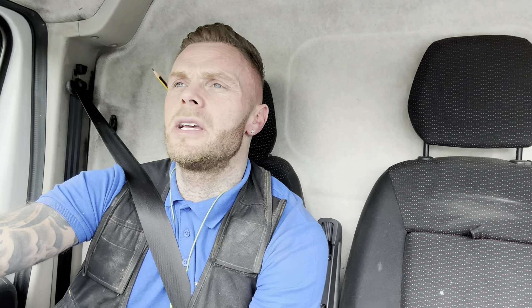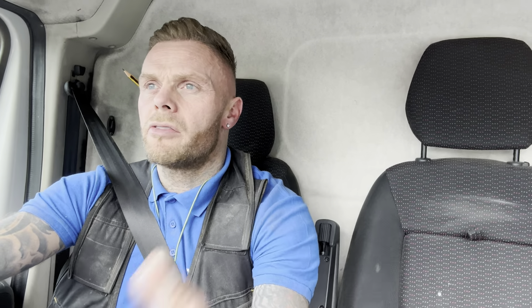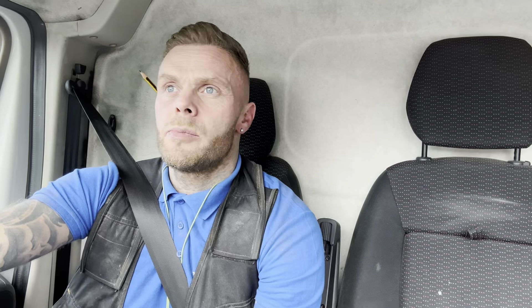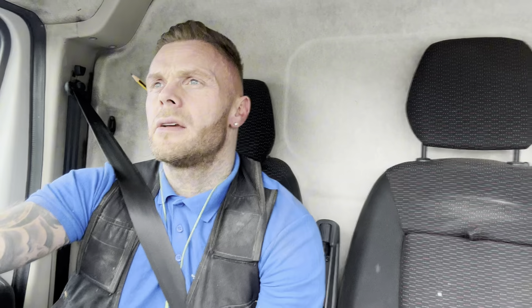Onto the tips - I'll show you all this when I'm in the booth as well. We typically tend to stick with a 410 tip, which is supposed to give you like an eight-inch fan pattern. If it's got a four at the start, they say double that and that's your fan pattern. We were using 310s, which I know a lot of people use, but then we tried a 410 and we just finally get better results - a bit of a wider fan pattern. That works for us.